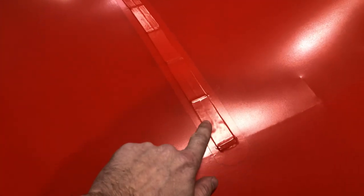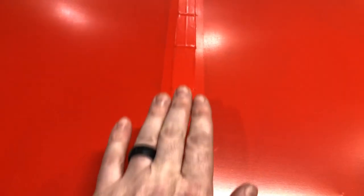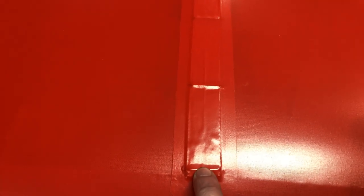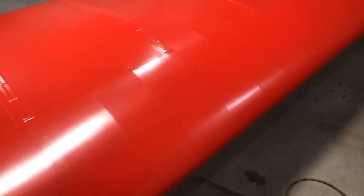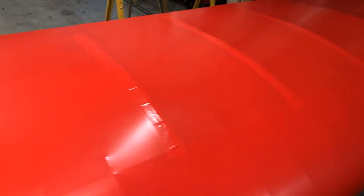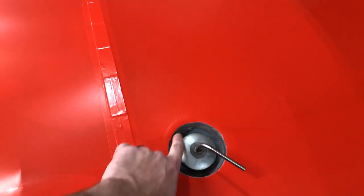Afterwards I put two layers of glue — kind of to build up the transition, because Oratex really sucks down in between — and to encapsulate the wax. I glued pretty much within an eighth of an inch on either side all the way down, so that when you go to put the tapes on the glue activates, encapsulates what little wax is left, and really makes those tapes stick. I had no problems whatsoever. So a little tip: if you're on the fence about using wax lace, I had zero problems with it.